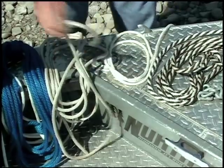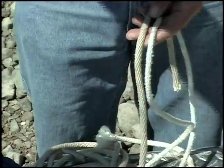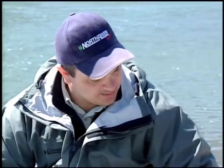As far as diameters go, a lot of times I see guys buying their anchor rope and they see they've got a 20 foot boat so they go buy a half or even five eighths inch rope. But with this type of breaking strength, 3/8 inch rope is all you would ever need. A lot of times when I'm sitting in fast water I'll even shrink down and use a 5/16 inch rope. The reason being is that there's so much drag on just the rope that it'll help you come off anchor. The less drag on the rope, the less pull there is on your anchor. That half inch rope's dragging so hard it's helping knock yourself right off anchor.